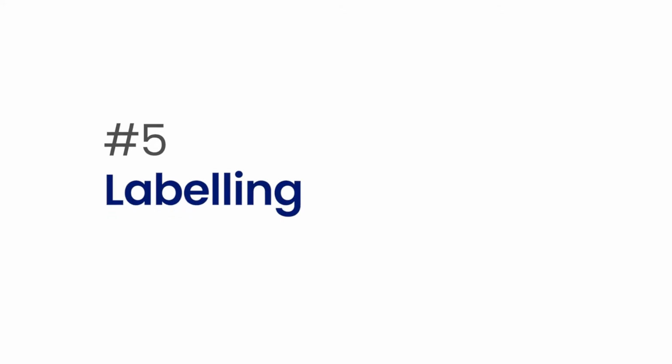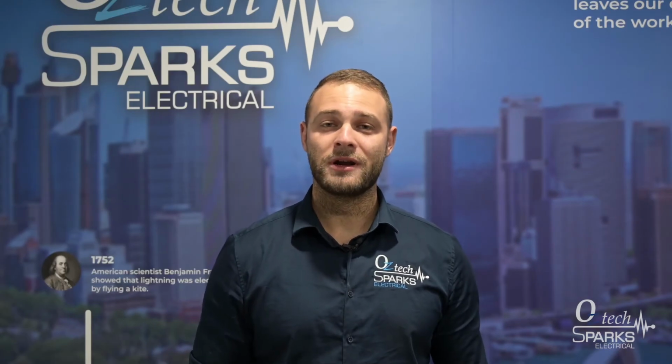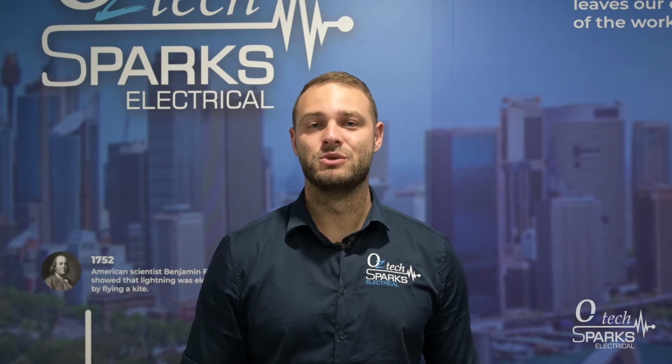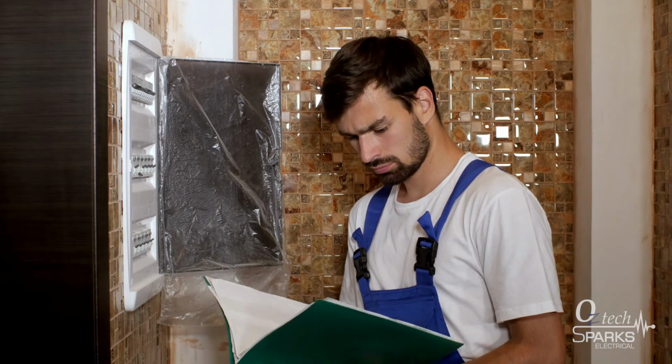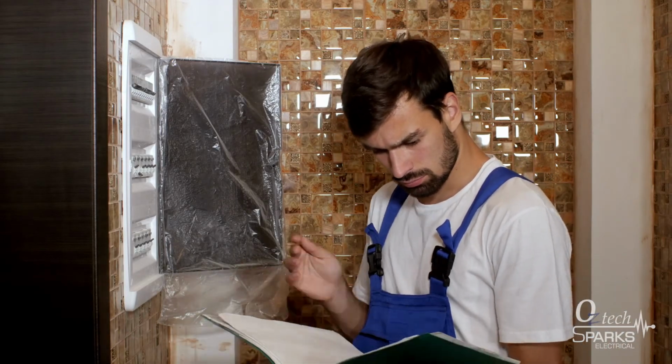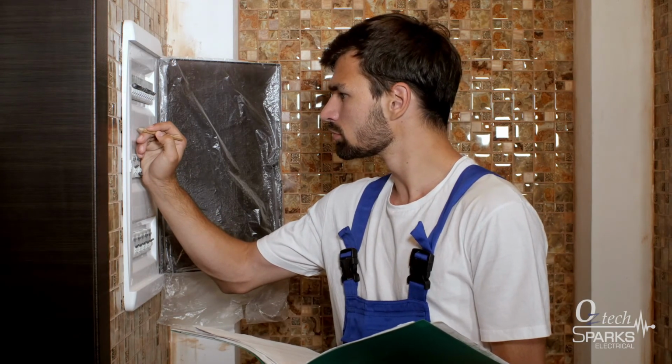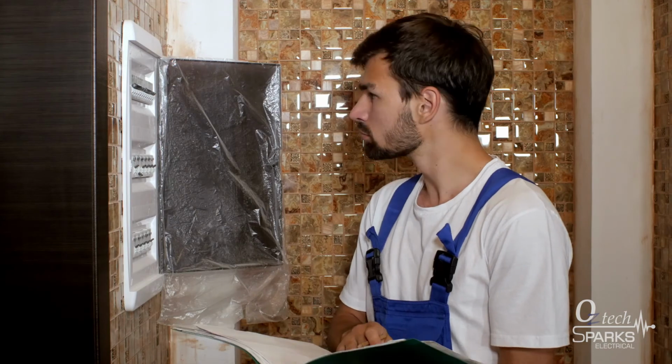We are on number 5. We're going to be talking about labeling. At Oztech Sparks Electrical, we are proud of our standards and we've seen it all, and a pet hate of ours is incorrect or poor labeling in switchboards. Each circuit in your switchboard needs to be correctly labeled, whether it's a power circuit, a lighting circuit, an air conditioning circuit, or a stove circuit. Every circuit has to be labeled correctly, referencing to what that circuit is taking care of.